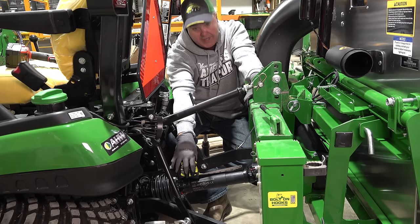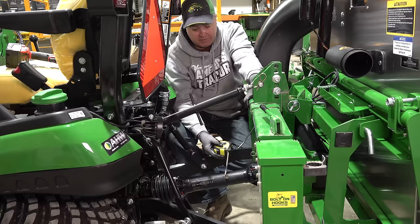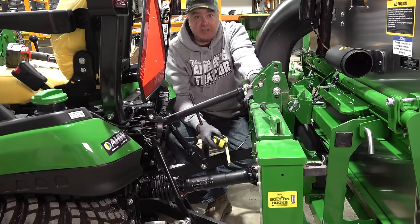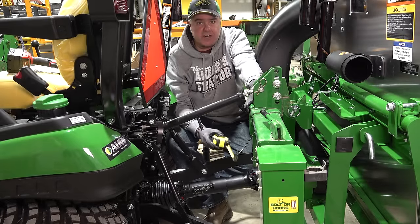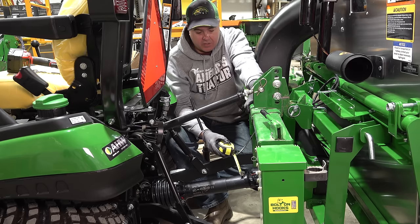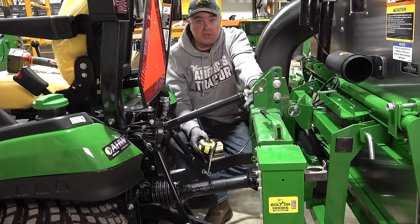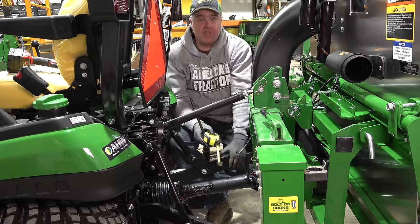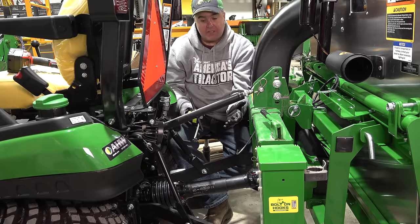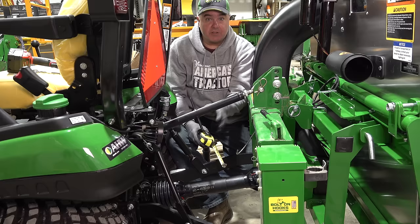That's what it looks like when it's fully attached. We have roughly three inches of play here — this is the critical measurement. You need to never use up all of this gap; even half an inch when at its closest point is fine, so we've got plenty of room to spare. Our way of measuring was maybe a little more aggressive than it needed to be. If you're short on shaft, cut a little bit less than the measurements indicate; if you've got plenty of shaft, it's nice to have that extra to get it connected. I'm going to raise and lower this attachment to see how that changes — you need enough PTO shaft at the fully raised and fully lowered positions to make sure it doesn't compress and force something to break, either in the tractor or in the attachment.